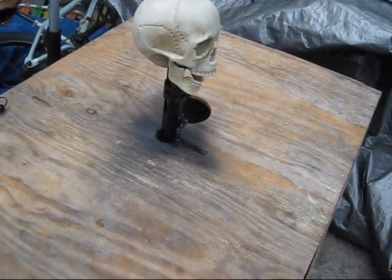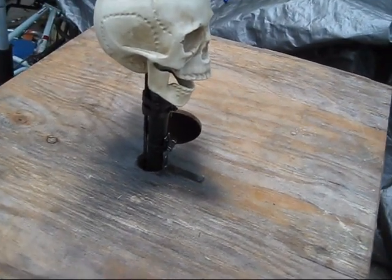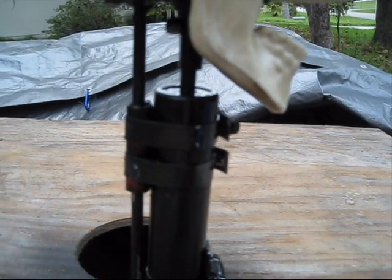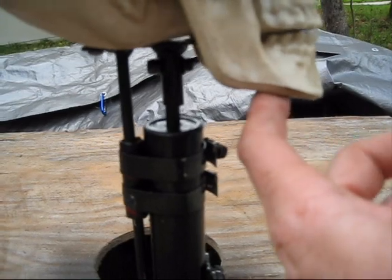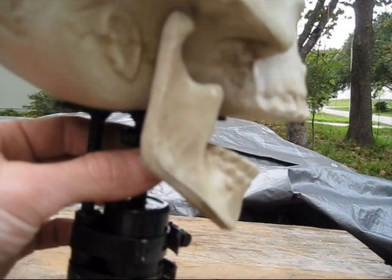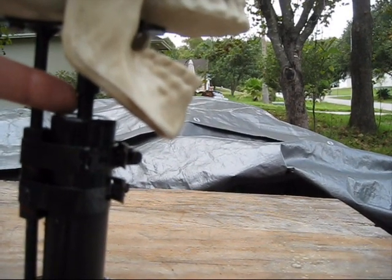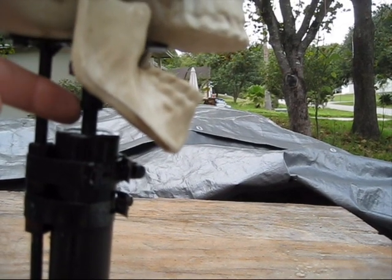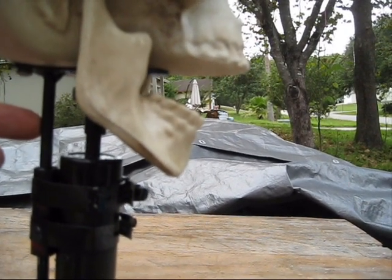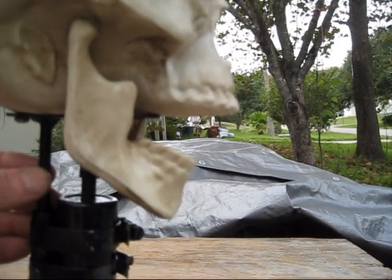This is the final iteration of the DIY pneumatic cylinder made out of a screen door closer. I've added some mechanical pieces — all this is meant to do is keep the rod from turning. Because of the spring inside the cylinder, the rod and piston turn a whole lot between extended and contracted positions. I tested it without this little rod and it was spinning a full 90 degrees, which is just too much.